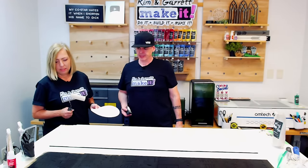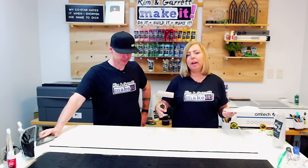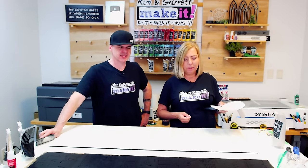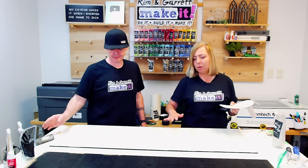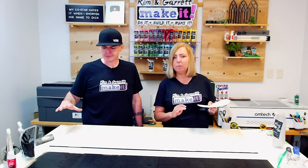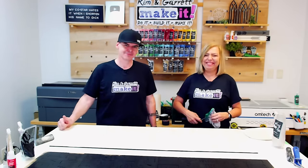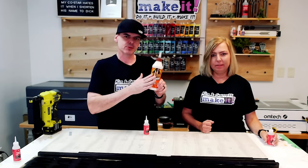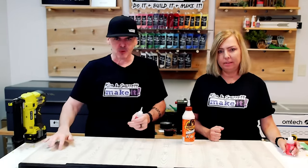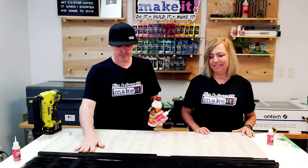The backer looks great. With this technique there are spots where the paint is still thick from pulling across with the wood graining tool, so we're going to let this dry for a while. Make sure all the thicker paint areas are dry before adding letters. The score marks are still visible through the paint, which is great for assembly. Step five: time to assemble. We'll bring it together with Star Bond Thick for the letters, and wood glue for the frame. Put Star Bond inside the score marks, pop the letters out of the frame, and glue them onto the board.